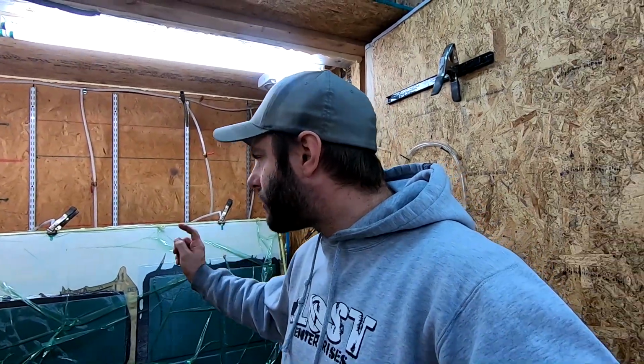So what we're going to do now is close the oven up. We're going to bake this at about 130, 135 degrees for about 3 hours. I went a little bit slower on the mix ratio on this because, again, it was a pretty large infusion. I just wanted to make sure I had plenty of time. I mixed up a tiny bit extra, but no big deal. So that's the epoxy mix ratio that I use. If you're doing one, look at your material sheet. It'll tell you the range of temperature and time and everything. Every epoxy is a little bit different. So let's close this up and then we'll see what it looks like when we open it up.